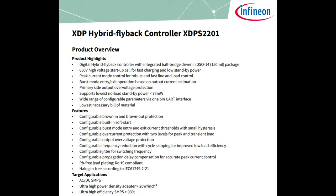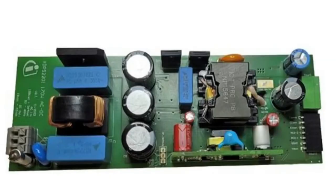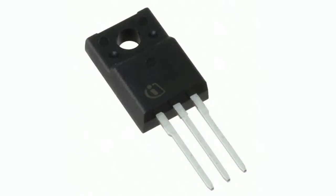It's a hybrid flyback controller. The featured product on digikey.com/new was an eval board they have for this chip. This board takes AC power from the left and converts it to high current DC power on the right for charging batteries. It's an evaluation board for large battery charging, and it features CoolMOS FETs with ultra low RDS on.